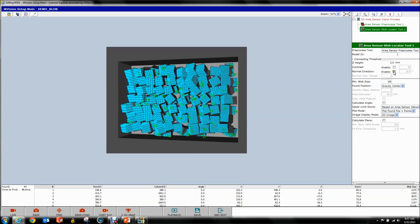While this is an OK result, it's not necessarily what we're looking for, so a few things we can do. Enable Normal Direction, and just take my word for it — set this to 5 and set this to 20 for now. It'll compare normal vectors, and if they exceed 20 degrees between adjacent points, that generates a cut. Select Find now and you can see things got cleaned up and there are several different new parts.